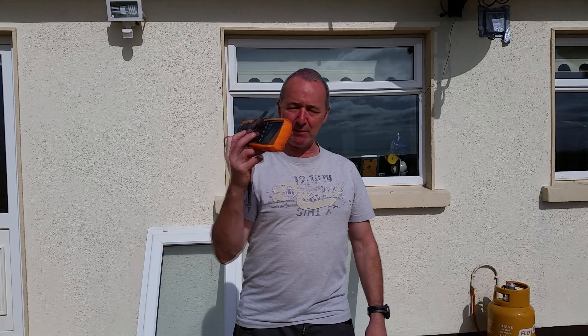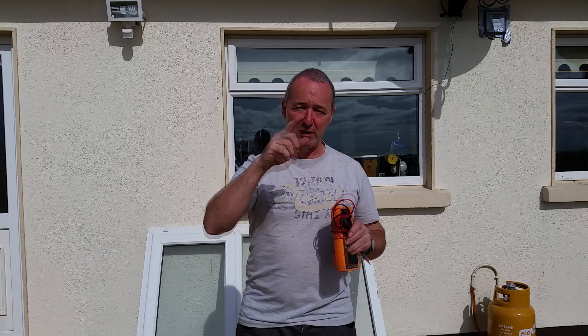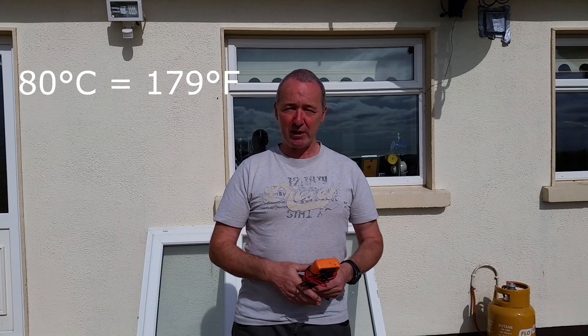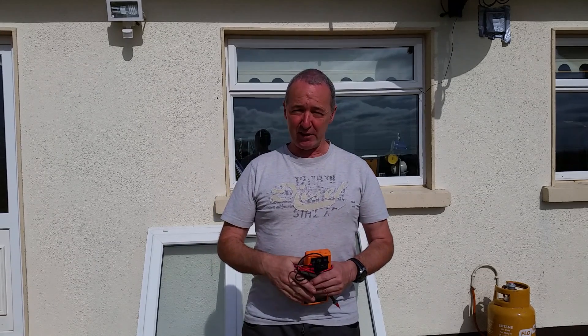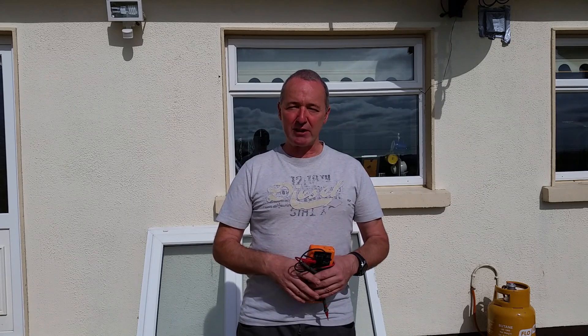So that's it for the solar. With little more than a meter, a couple of meters of pipe and messing around on the back of a window, I can find out before I even start going into production what it's going to take to make a solar panel. In my case I just need an old window with double-glazed units, some insulation behind it, and some copper. Before I even go at it, I know I can achieve in excess of 80 degrees centigrade in springtime. That's going to be continually pumped down into a storage vessel — a hot water cylinder — and I'll probably do some sort of a drainback system. The hard part was to find out if it was worth doing, and with just a few minutes messing around it was very easy to find out.